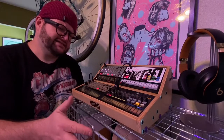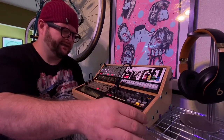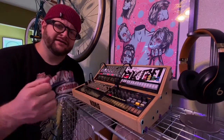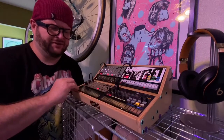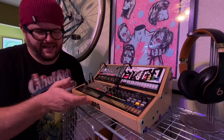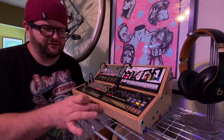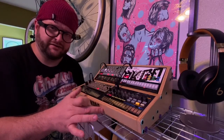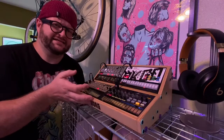For the 60s and 70s look, I chose half-inch pine-based plywood. I really feel like it's a quintessentially 60s and 70s kind of material and one of my absolute favorites. It was built with a table saw and the CNC. I also wanted to add some logos — a lot of the early synthesizers had screen-printed logos on the front and back. I did it a little differently: I put this in my laser cutter and debossed the Korg logos. There's a big one here and a big one here — it's got a nice little tactile feel.